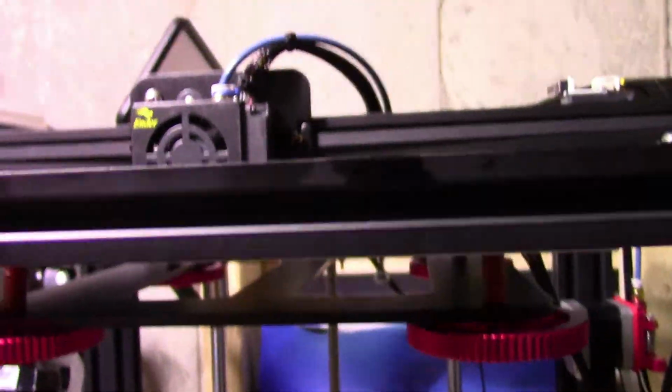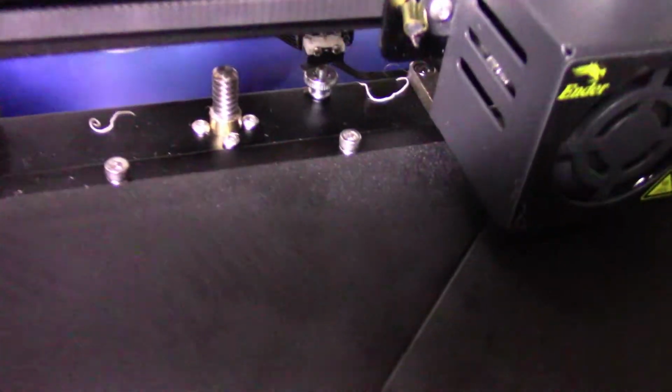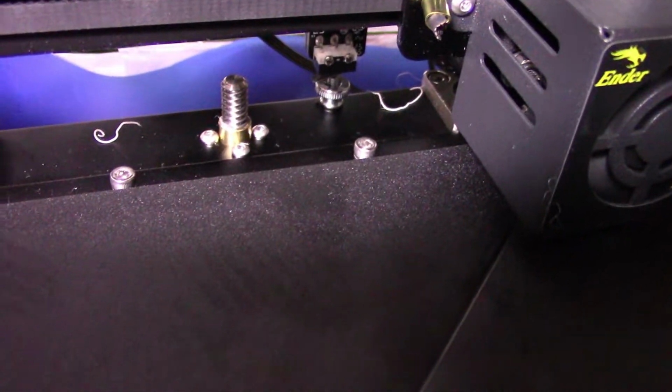Okay, I'm gonna troubleshoot this and resume my vid. Yeah, so I messed up my bed really bad. So this batarang that I'm gonna print is not gonna come out right. So basically what I just did was I adjusted this stopper screw in the back, and hopefully that's gonna be the difference. Now I made it so that it's impossible for it to grind like it's doing.